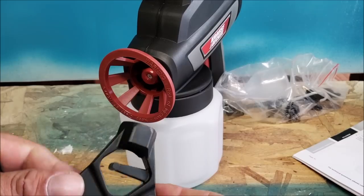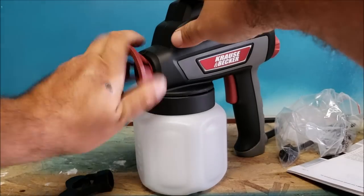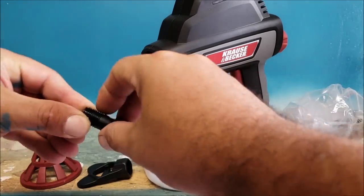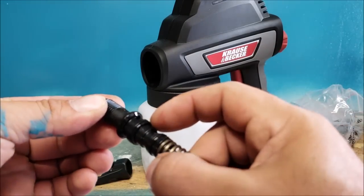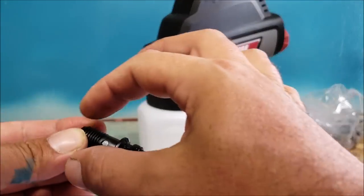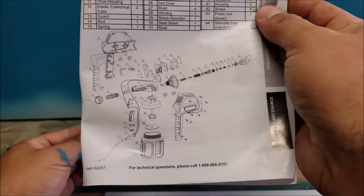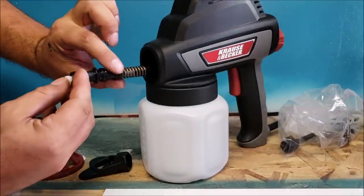The gun comes with a little wrench so you can change the nozzles out. That's what's all in there — this is where you're putting the lube to lubricate all these parts. It has some O-rings right there, and a lot of times they don't know how long it's going to sit on the shelf, so it could have some kind of special factory lubricant that we need to wash off before we start. There's also an exploded diagram in case you get confused — it can fall apart, so be careful.